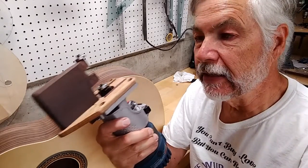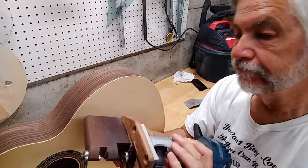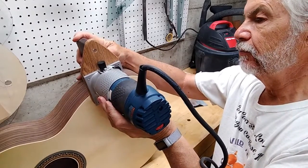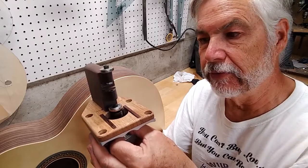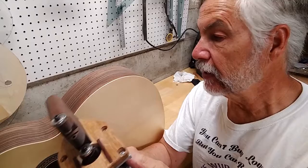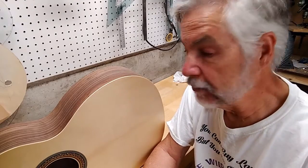It is kind of a skill to use this — it's not something you're just going to be whipping around. You do need to hold this properly in place in both directions as you're going around. And because it is basically a fly cutter of sorts, it's only got two blades to it. You have to go the right direction with the grain, or you could chip out the wood. So, hopefully you know what that means.